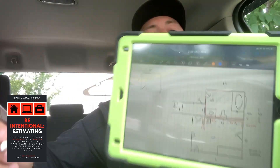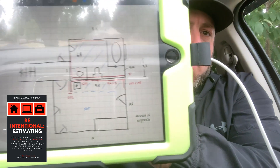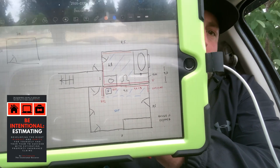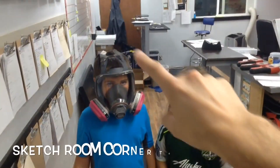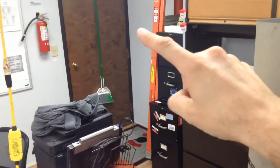I think some of the most important things — put the door and the swing in your sketch. And you'll notice, for those of you that are watching, I like to use notes and colors. Red would be where the flood cuts are, blue is where the floor was cut out. We need to measure from that corner to that corner, to that corner, back to the corner that we started in.